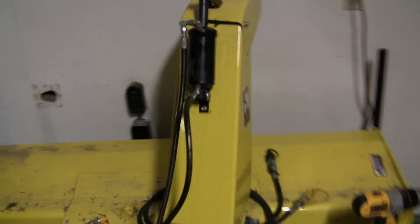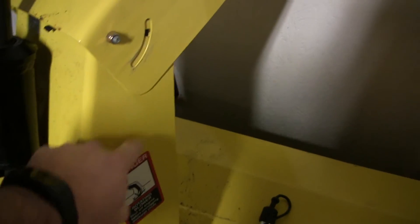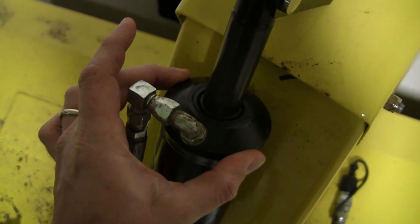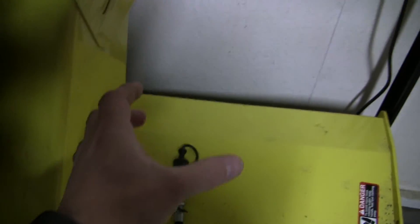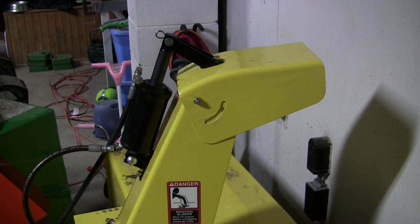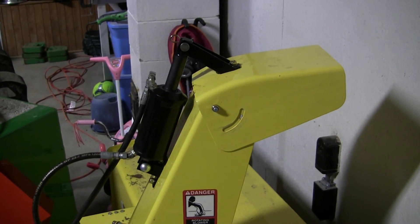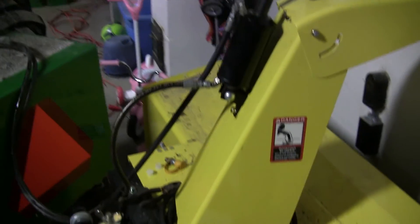So that's it — it makes good use of the third valve and I think it came out all right. I know a lot of people put them on the sides and run it from here up along the side, but this is a thick cylinder — if you're familiar with the 2520 or the 2000 series lift cylinders, it's a thick cylinder — so I didn't want that great big thing sticking off the side. It gave me an excuse to build that lever, and it took a little more work to make sure the lever worked, that it didn't run into the chute, and that it didn't over-extend the chute with the cylinder or break it when pulling back.